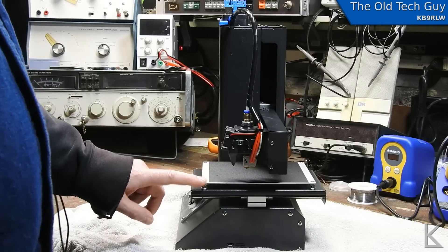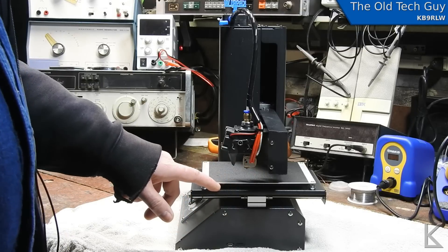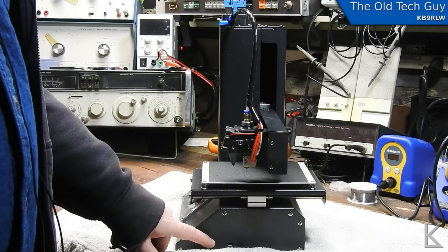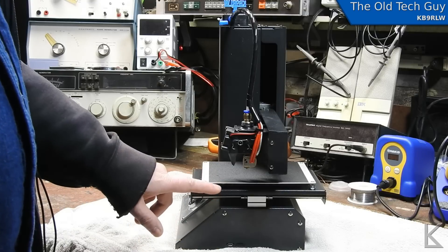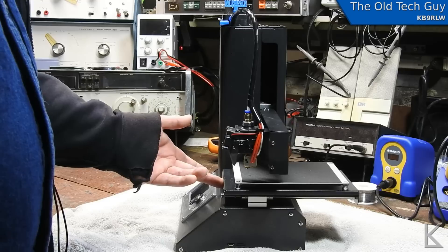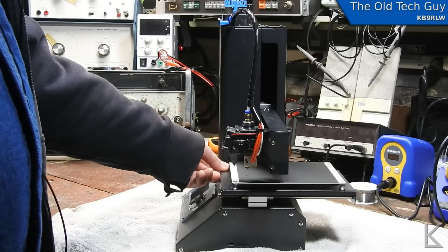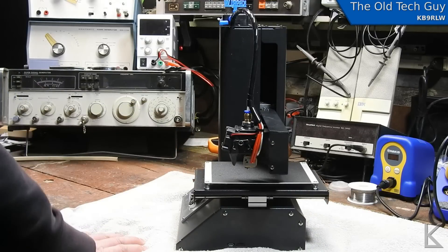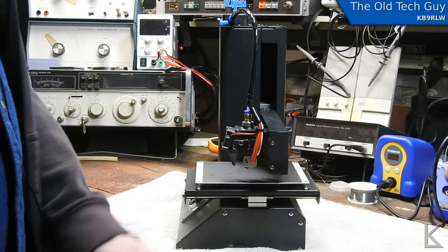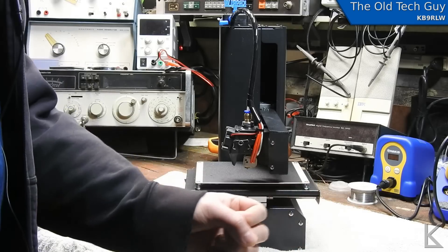This is a heated bed. That means this aluminum plate on the bottom side has a PC board heater that covers the entire bed and a thermistor. That's used to heat the bed up to help plastic adhere to it, and the thermistor feeds back the temperature to the controller so it can maintain the temperature. So that means there's wires connecting to this bed going down into the chassis that have to contend with all of that motion. I can feel the resistance increase as I move back where I'm starting to pull on those wires.